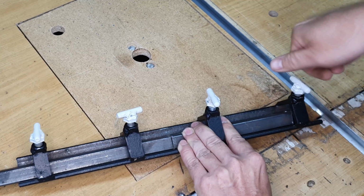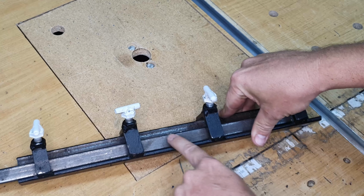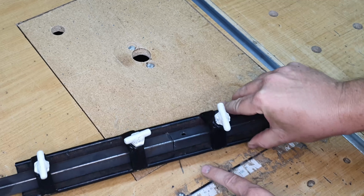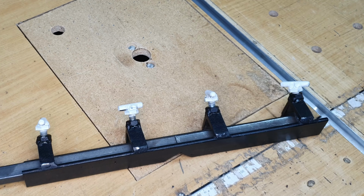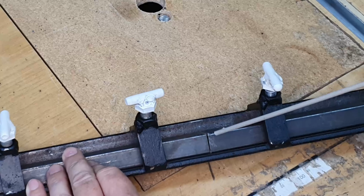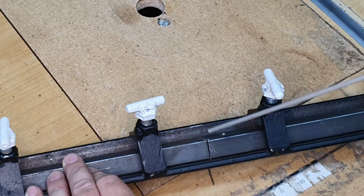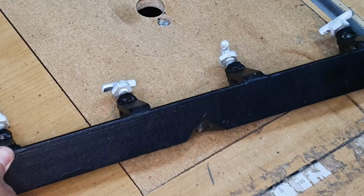And once this is done and it's being kept in place by the 4 bolts that keep the 2 pieces of tube or angle iron or pipe together, you can then grab your welder and simply tack it on the top to join the 2 pipes together. You don't have to weld it all around, and you tack it to keep them in shape.